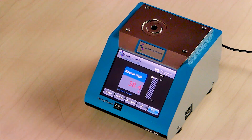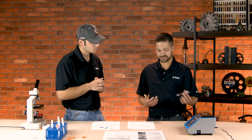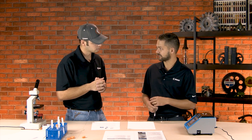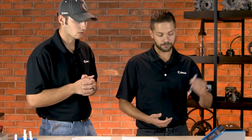Here you see 38.4%. This grease sample has a lot of iron in it. Yeah, that's a lot of iron — we'll let your customer know about that. You can see a lot of different industries will be interested in the opportunities of grease analysis. It's great for your oil condition monitoring program to include these grease applications. It's not just oil — now it's grease.